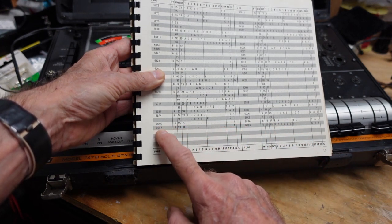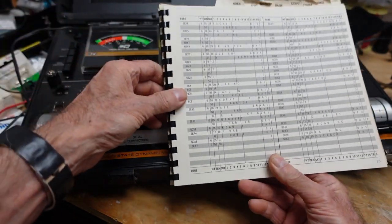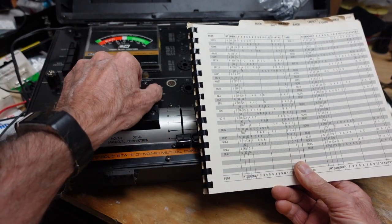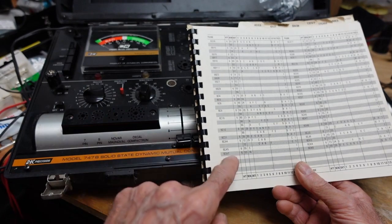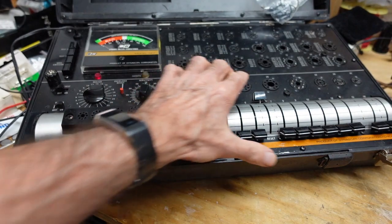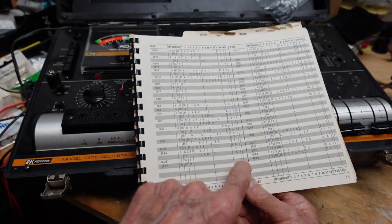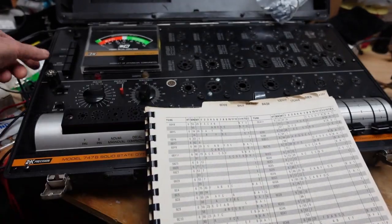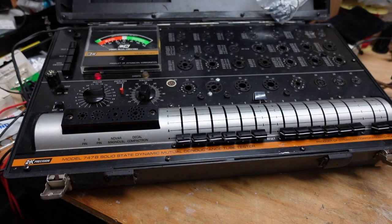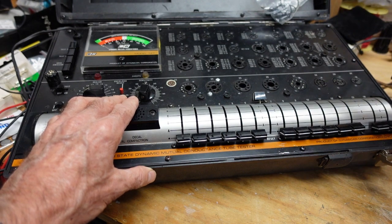So what you do is you select your tube, and your heater gets set to 6 volts. Your sensitivity gets set to 53. Apparently I use it on something a lot like this. And you use socket 14, which is right up here. And we make sure that none of these are selected because you notice these are all blank, and this says 1, which means test button. We have test button 1, test button 2, grid emission, and shorts. So we're going to put this in 14 and see what we get.